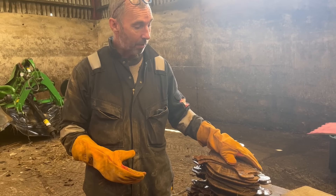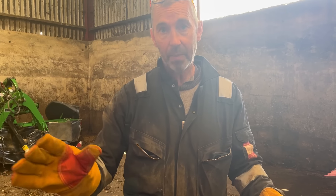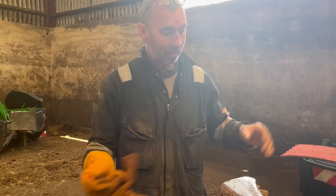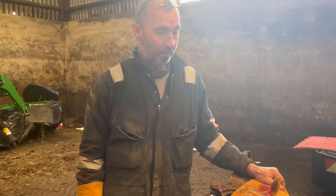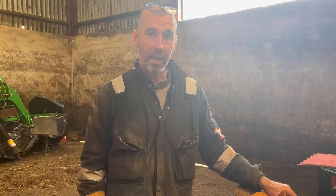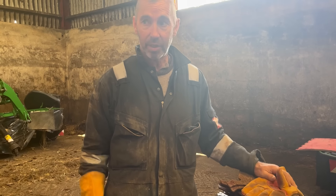So I'm going to sharpen all these manually now with the grinder. All these blades are in that row there that you've just seen. The grass gets fed through them and it gets chopped smaller. So when the grass has been cut it's quite long - it gets chopped down to a length of about that much. It's chopped much smaller so we can get a lot more in a clamp, we can roll it a lot better and it's better for the cows to digest. The mowers originally cut the grass, so the wagon is just making it that bit smaller. The mowers just cut the grass and basically lay it flat for it to dry - it doesn't get chopped at all with the mowers. It can get conditioned, which means it gets beaten slightly and gets spread and helps it to dry. This is the chopping that's done on this type of system with this harvester.